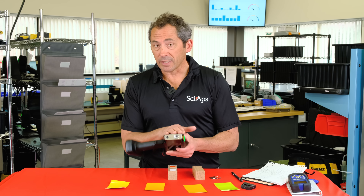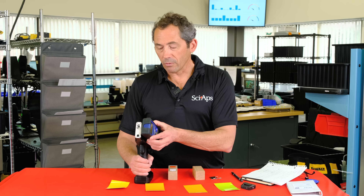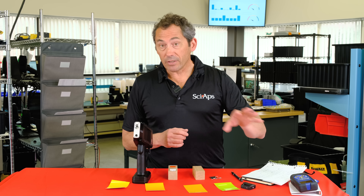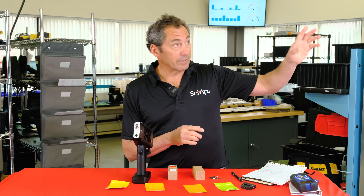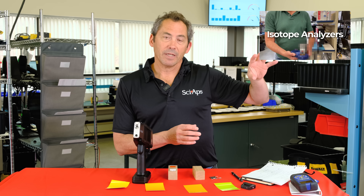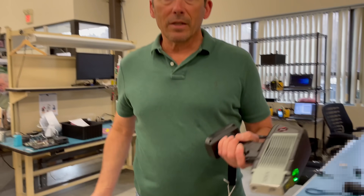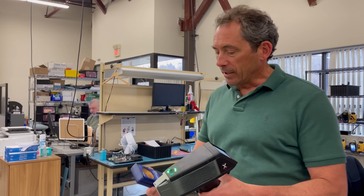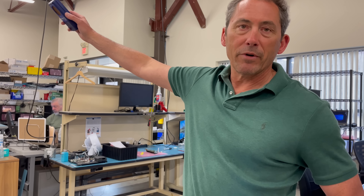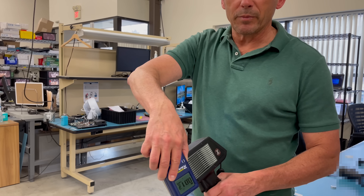When the device is not in use, take your everyday Geiger counter — there's no radiation at all, no x-rays coming out. As you can hear, there's just a click every couple of seconds, which is background radiation. When you put the counter up close to the device, there's no change — no x-rays are being made when you're not actively using the device.